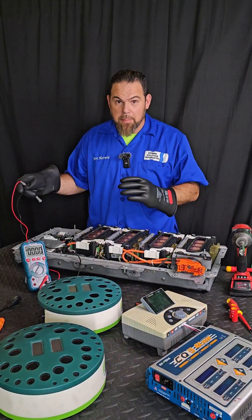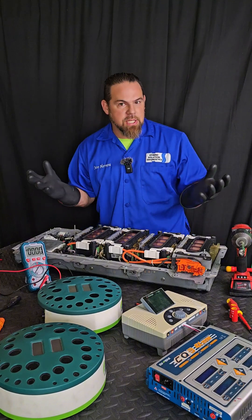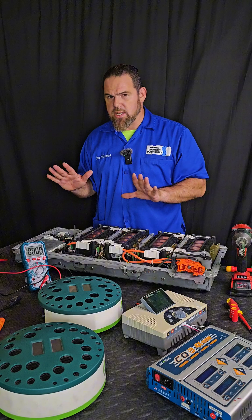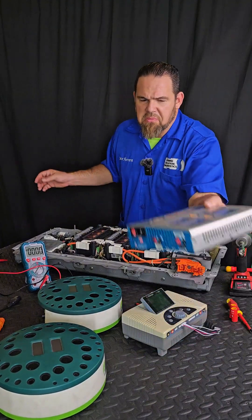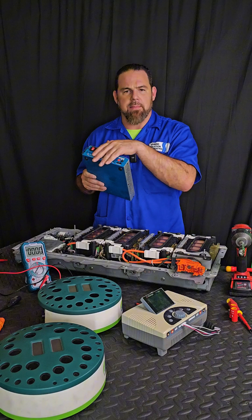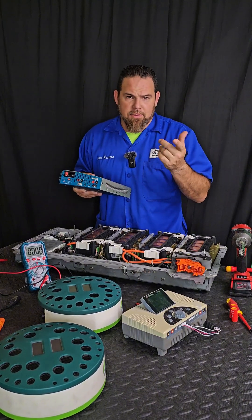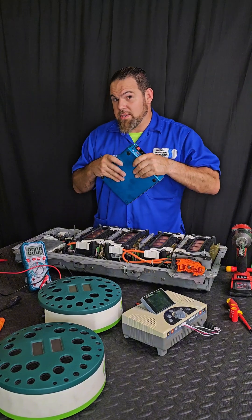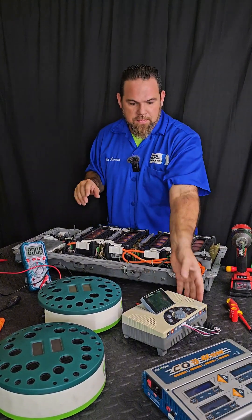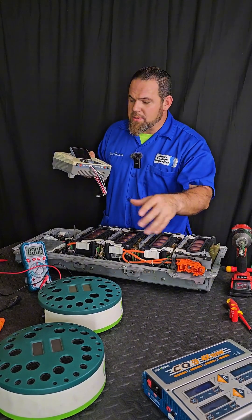This is a lithium battery — so which machine do I use to charge it? You have several options. You can completely disassemble the battery blocks and charge the cells individually using something like this RC charger, which has four channels and can handle nickel metal hydride, nickel cadmium, lithium-ion, and lithium iron phosphate chemistries. However, it only has four channels and there are many individual cells, so you'd need a lot of these.